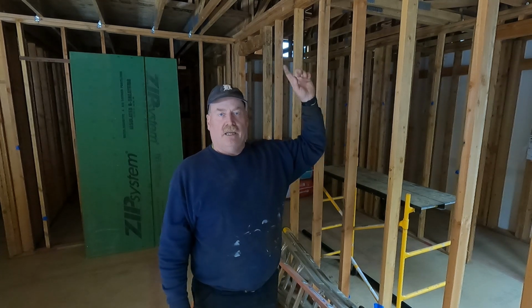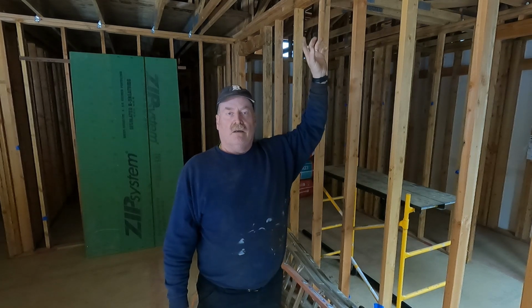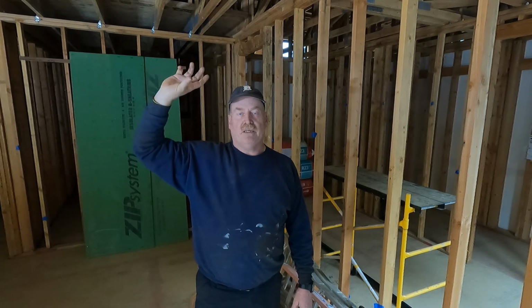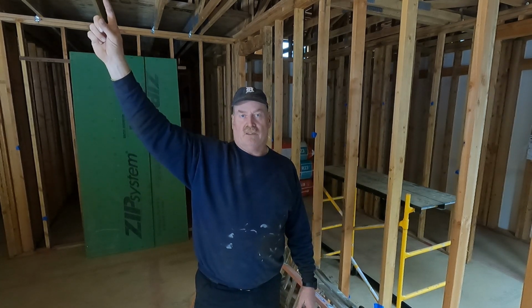So what I ended up doing was I made a false chimney on this side of the house, which is kind of the main part of the house, and then the other chimney on the other side of the house is where the fireplace chimney will go up. And I'm gonna pipe all the piping on the in-law unit side up into that same chimney chase as the fireplace chimney, and have that plumbing vent go out the top of that.